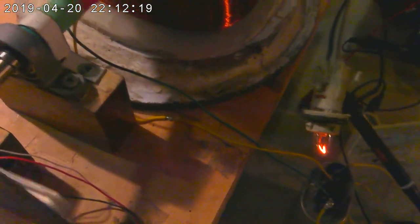Oh, you hear that? It's chugging like an old Datsun, and I know exactly why that is. I'll turn it right down. It sounds much like what I was concerned would happen. The coupling between the shaft and the magnets has loosened off a bit and thrown the timing out. That's quite easily done. Just the vibration is enough to do that because it's so unbalanced.